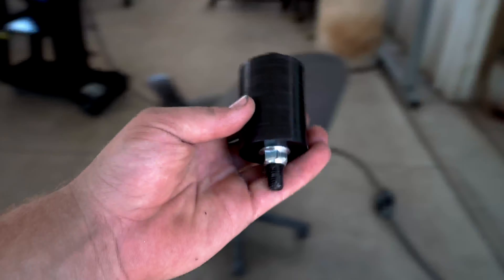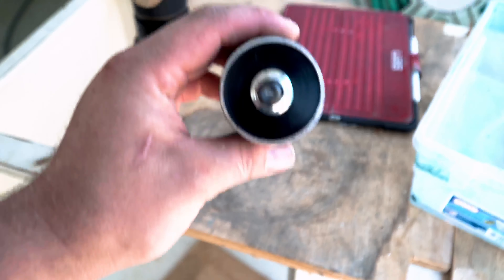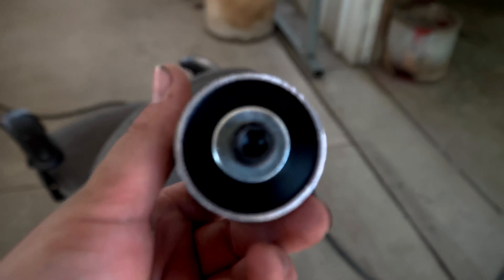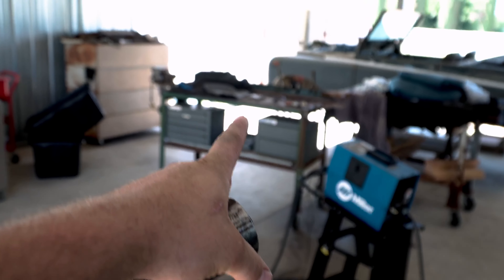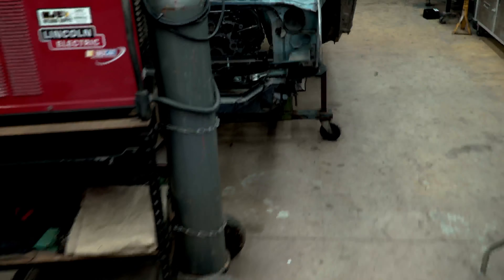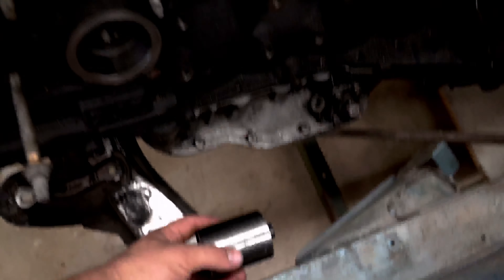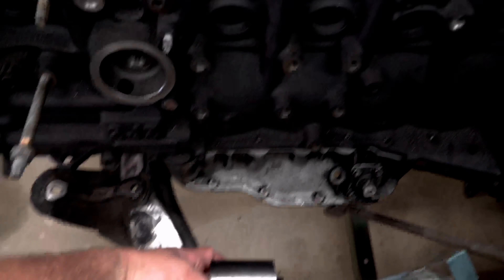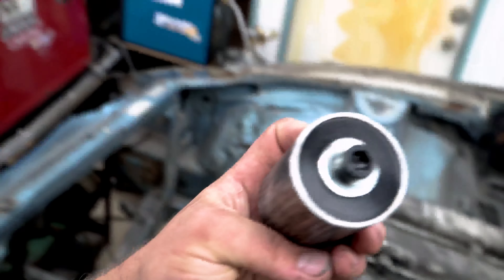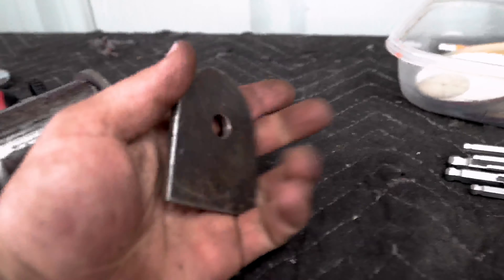Another update: I got bushings in the mail. I just turned them down on the lathe at my grandpa's house. They're going to be going in a sleeve or pipe like this, and they'll have a custom arm welded from the X-plate engine mounts to here, and then to the section right about here on the frame. Then they'll bolt in right about like that. She's coming along.